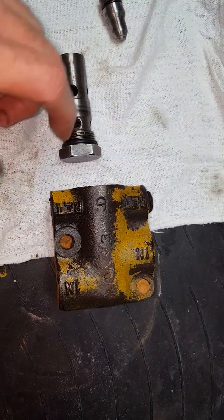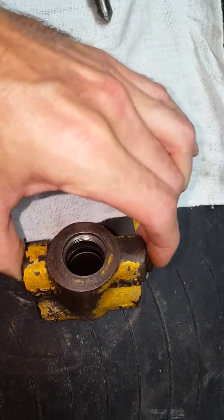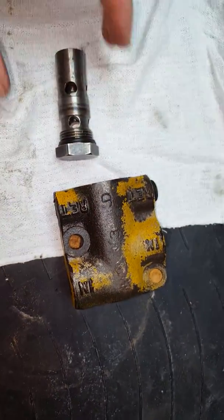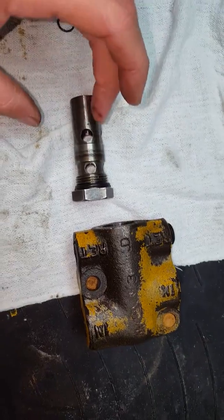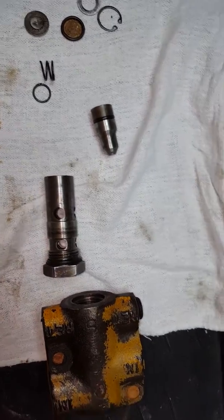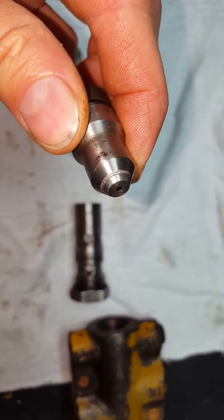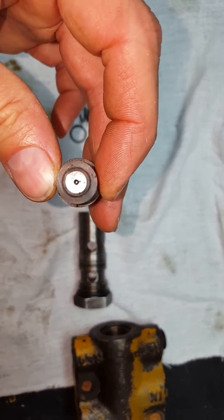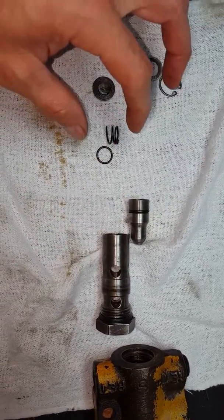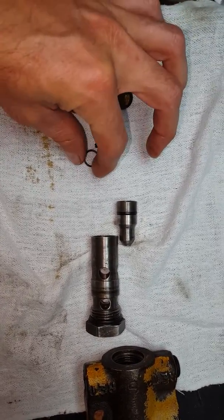On the return side it goes back to the tank. I looked for these assemblies and I couldn't find this one — not that they weren't out there, but I worried a used one would give me the same problems. You can see that it's pretty worn — there's a pinhole on this one so it always lets some fluid through. On the back side of this there's a spring, and this is where mine was really bad: my spring was broken, so it wouldn't build up pressure.